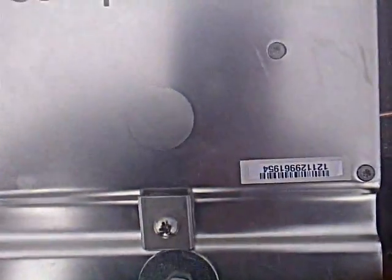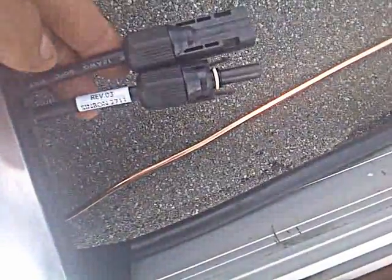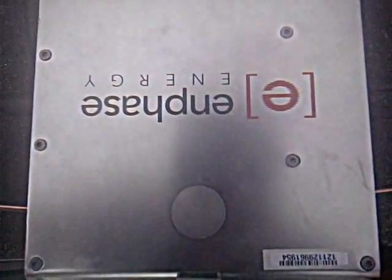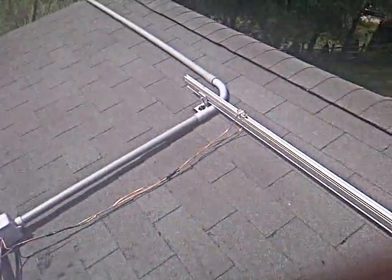And when you're done that, you take the inverter and you mount it over here like that. Bolt it down, and you take these other two leads here for your positive and negative, plug them into your panel, and it converts all the DC to AC right here. So running through this whole cord is all AC — it's all AC off the roof. There's no DC, which is a nice thing because it's smaller wires you can use. You don't have to use a big-size wire when you're running DC off the roof down to the electrical panel. Plus you have to use metal conduit when you're running inside — we use PVC because it's all AC, so you're allowed to do that.